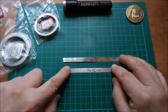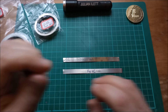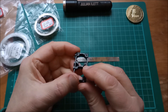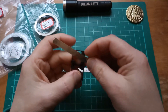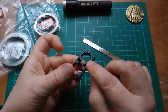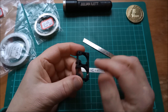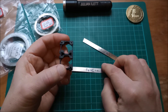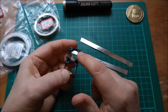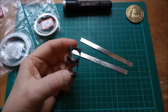I went for the 8mm wide strips of these metals because this is an 18650 end holder, and you can see that 8mm fits with a nice little bit of wiggle into these strip slots. For bigger cells that gap is larger, so I wanted the biggest strip that would be kind of universal and fit on 18650s and above size cells.